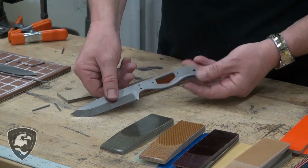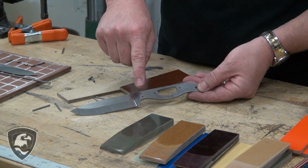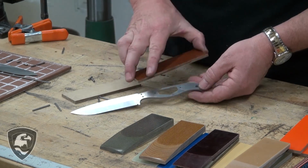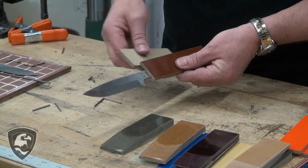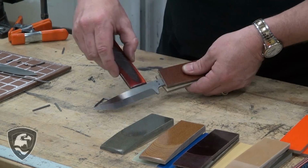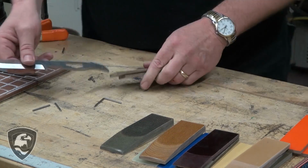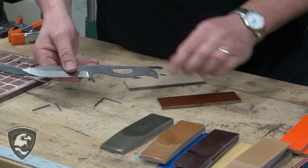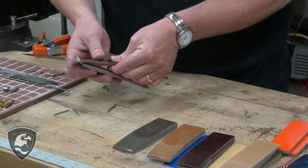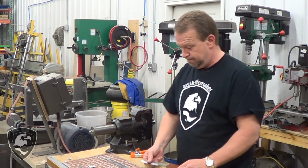In this particular blade style, we have 2 extra holes right up front here for a metal bolster or a wooden bolster, a different color micarta or G10 bolster that you could put on there. The idea being that you would mount your knife handles right there, and then maybe a different piece of material up there like that. Obviously that wouldn't go there, but you get the idea. So today we're going to elect to fill those in, and we're just going to bring our scales all the way up that way and not necessarily mount a bolster. That's for another time. Okay, so let's get started.